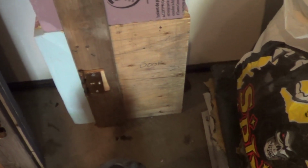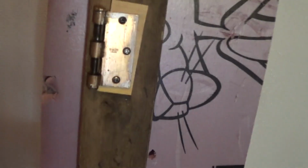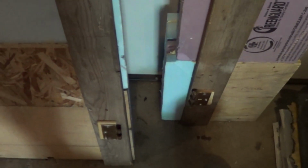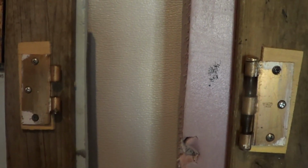The same kind of structure exists for the jambs. The same piece, 17 inch, 3/4 inch plywood, a 1x4 glued on there. I used Gorilla Glue on all of this. Still not certain whether it was the right choice or if I used enough, because I've had some separate, but it is what it is. And then these hinges. So this is how everything is going to connect. Pull the hinge out, pull the pin out, hinge to hinge, and then you have a side. Rinse and repeat for the other side, and away we go.